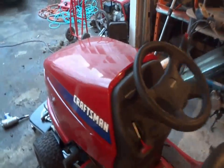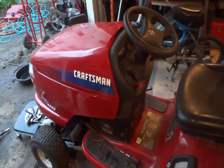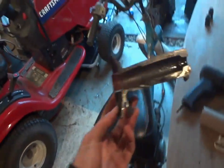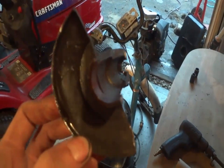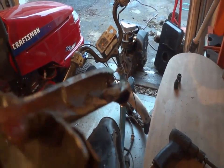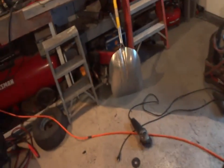Then I also had PJ's old tractor in - his old DYT. So that was kind of ironic, I had two DYT 4000's today. When PJ's DYT 4000 came in this morning, it was originally only getting a PTO pulley put on it. The old pulley was completely seized onto the shaft - we rigged it up to like an LT1000. So I had to cut it off, heat it, cut it, heat it, and it still wouldn't move. I ended up just splitting it off. It was pretty bad - took me almost an hour and a half just to do that, and it was not fun. It also had a big oil leak - oil puked out everywhere.